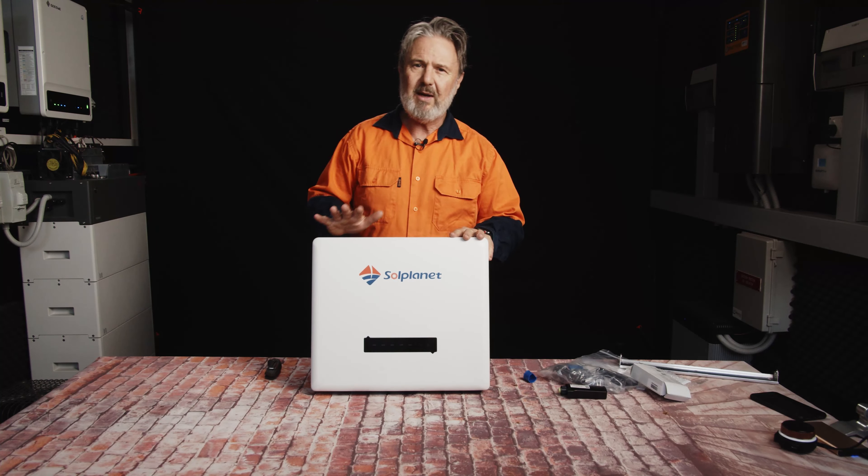One point I just touched on — I've actually done a separate video on it, linked above — is about the DC switch. What the requirements are, and also when selecting an external DC isolator if one is required, depends on your jurisdiction. If you're in New Zealand, currently you don't need one. In Australia, currently you do need one adjacent to the PV array. But this is the integrated DC isolator for the inverter itself. So hats off to Sol Planet for doing that — it makes the life of the installer so much easier. Anyway, that's the Sol Planet 5kW three-phase inverter. Thanks very much.